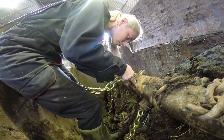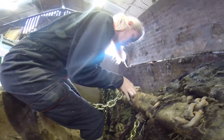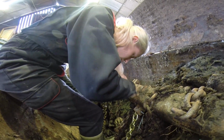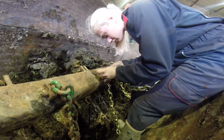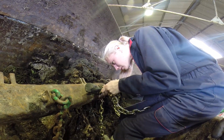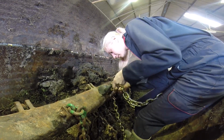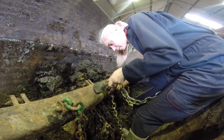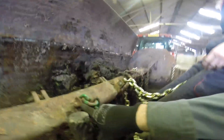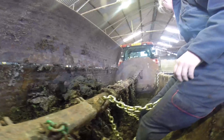That's it flat on rather than across the shoulder of the mount. So I don't want to try the other way around. It will do it. I'll have to give it a tap with the persuader. What, the hammer? Yeah. But only a tap because we're being careful with the threads. No, that's fair enough. Oh, it's going. All the way through, yeah? So what you've got to do is make sure when you're putting the chain in, that link is straight out. If you try and go at any angle, the shoulder of the mount will stop the bolt going in there. Right, okay. Got that?